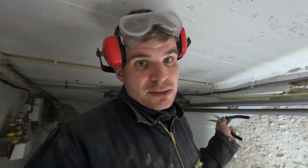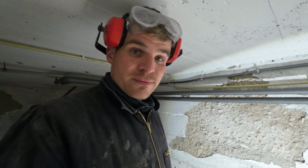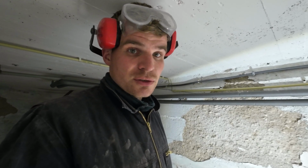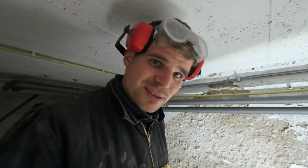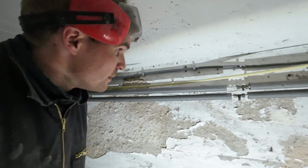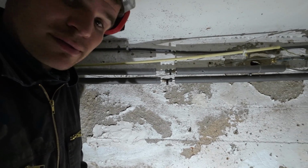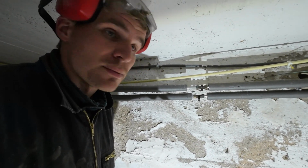So we got water lines all through the house just for the hot water, and that's for the radiators in all the rooms. So we're gonna remove that all because it's just so old. To do so, the first thing we need to do is get all the water out, otherwise it's gonna give a mess. I think it's gonna give a mess anyway, but having as much water out as possible, that's a really good idea. So we got here 2 drains, so these can actually drain the heating system if we unplug these, and then everything comes out.